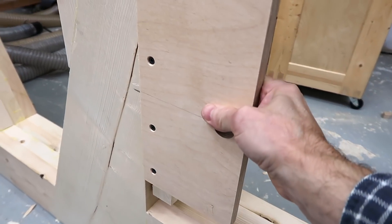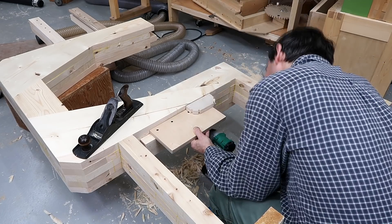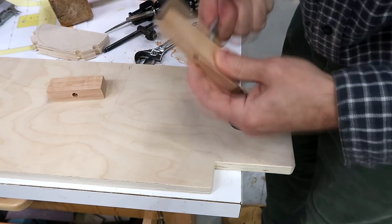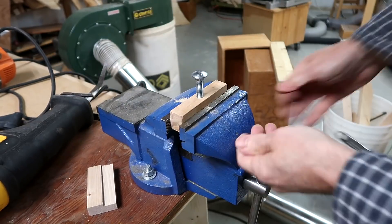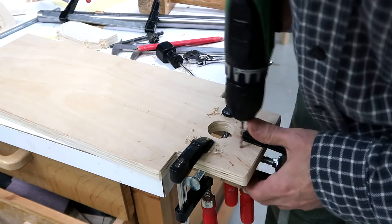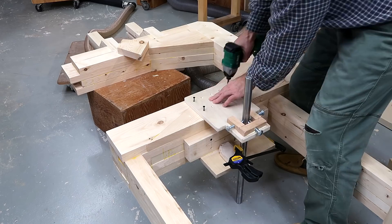The mount needs to go right here, but this needs a little bit of flattening first. I only partially threaded those holes so that the bolts really get stuck in there. This complicated contraption will allow me to tweak the alignment of the lower axle even once the bandsaw is done. I'm allowing that axle to be square to the frame and then I use the position of that axle to figure out where I should put the back support for it.